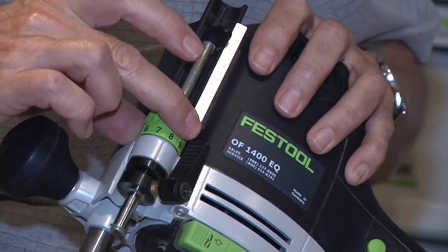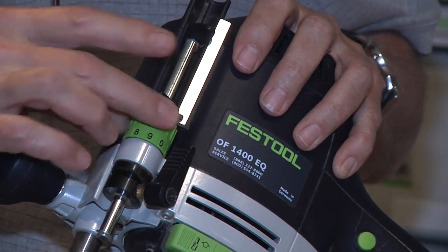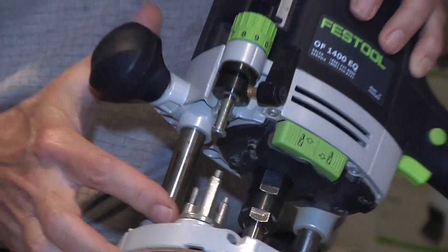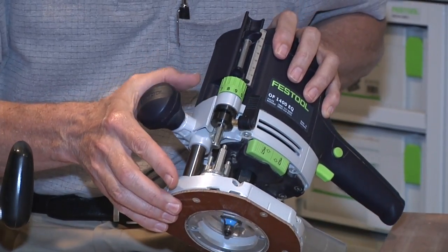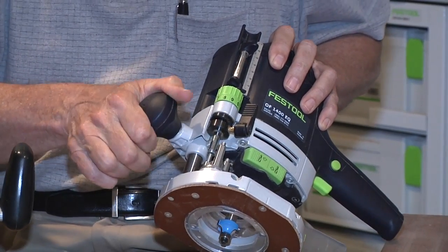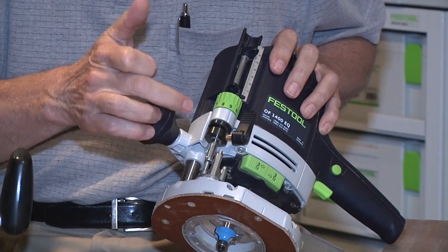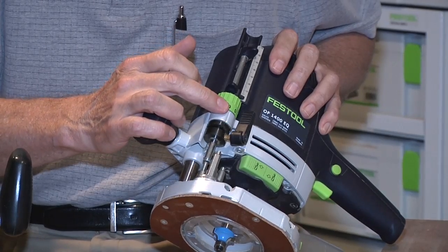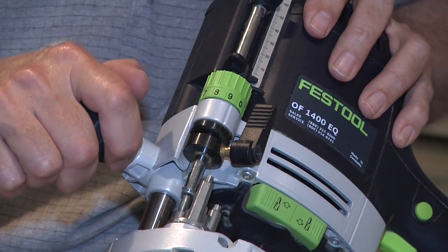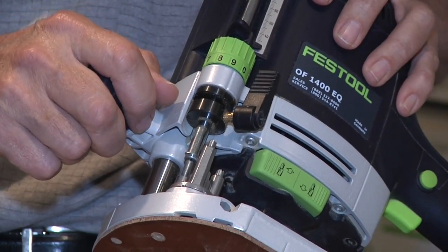Let's just move this 0.2 millimeter in one direction. Then when we bring our turret back, again, we're at the low level, we'll go on down, we'll lock the machine, and we're in business at just a slightly different level. 0.1 millimeters is 1/256th of an inch. So do 2 of them, it's 1/128th, etc.